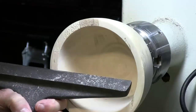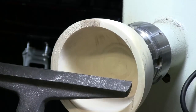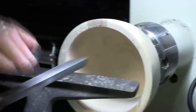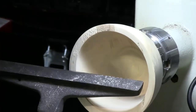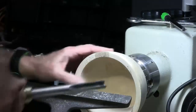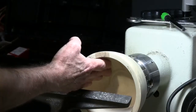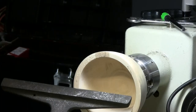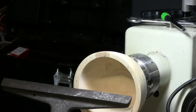At some point I sometimes give up on the bowl gouge — that doesn't bother me. I'll resort to using the scraper because it's easy to get rid of ripples and it's easy to deal with the flat wall on the bottom. The other possibility is switching to a different bowl gouge with a very flat, steep grind — about 65 or 70 degrees. The problem is when you come down and make that transition, those gouges at about 45 degrees can't keep the bevel floating on it because the angle is too short. You lose the bevel on the bottom and start making little ridges when you start swinging.